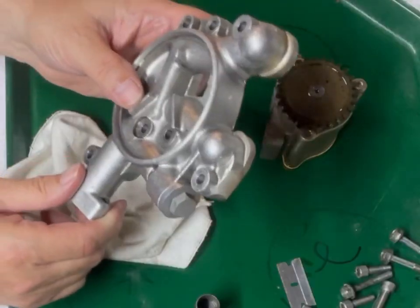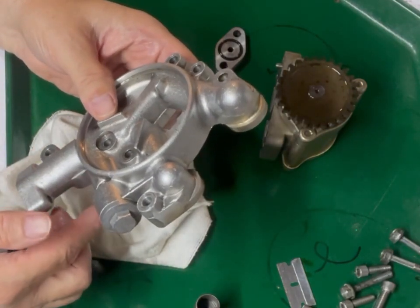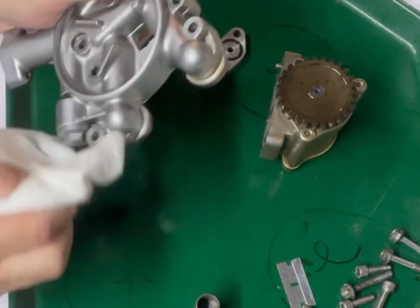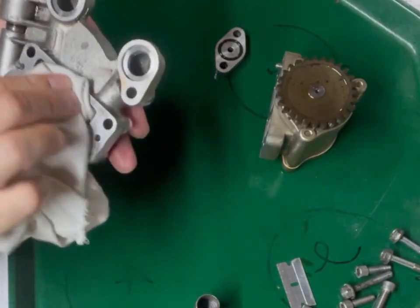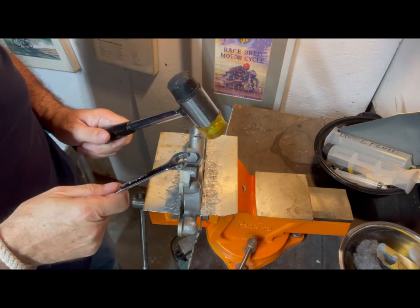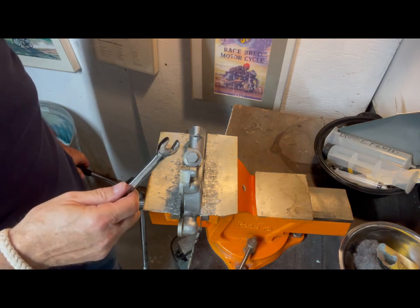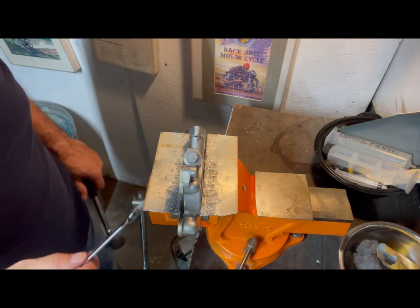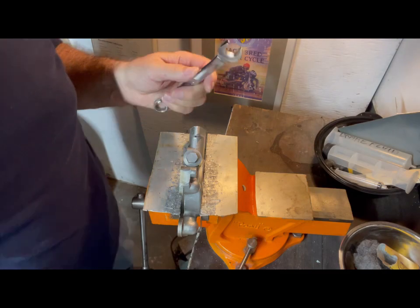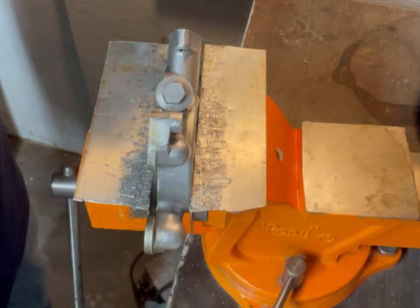If the oil pressure is too high, the pump will stop and it'll pick up oil through the bypass valve. This is where the relief valve spring lives, and that opens up when the oil pressure exceeds the normal level. So with excessive oil pressure, it bypasses oil right to the sump, and that maintains the same oil pressure in the engine.